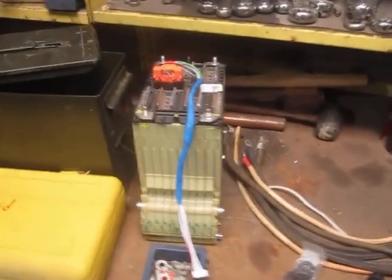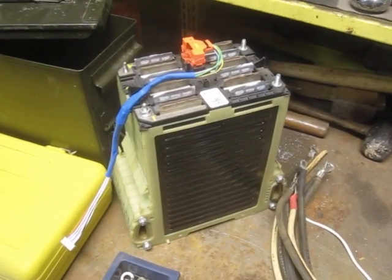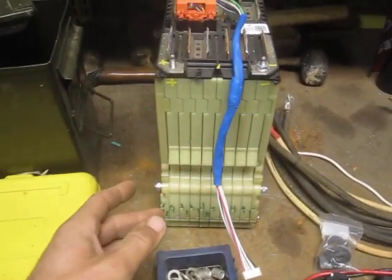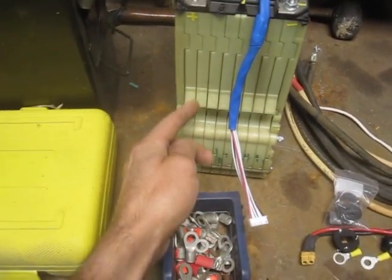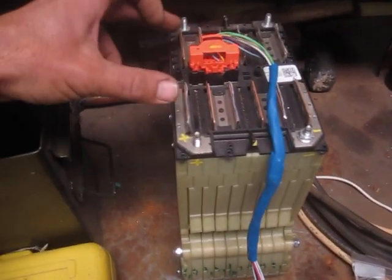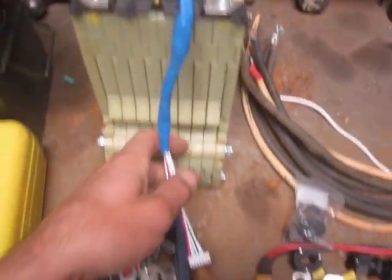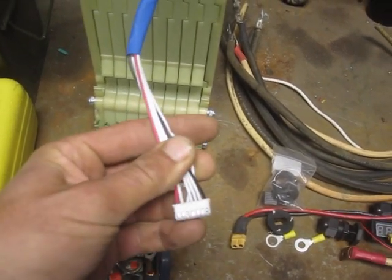Batteries. The starting point for my batteries are these 24-volt modules — six pouch cells. These are from Chevy Volt batteries. In between each of these plastic layers is a prismatic pouch cell, and the six of them pinched in the sandwich are all wired in series. You can pick them up at the top here, or out of this block connector, which I've brought out to a balance charger connection. The standard RC world JST-XH connectors — so I can balance them by just opening the cover and plugging a balance charger in.